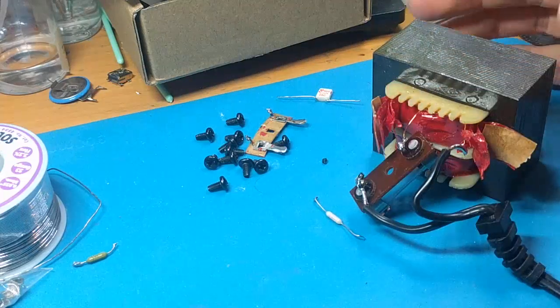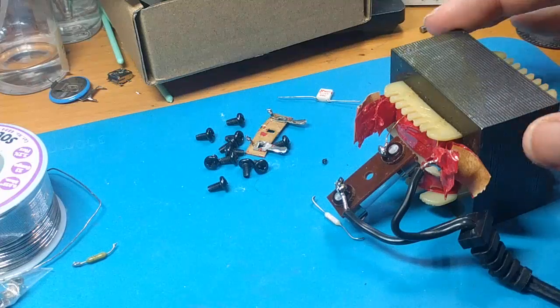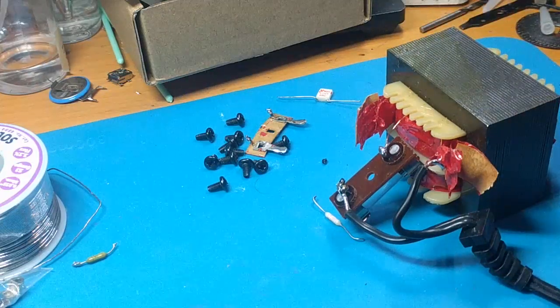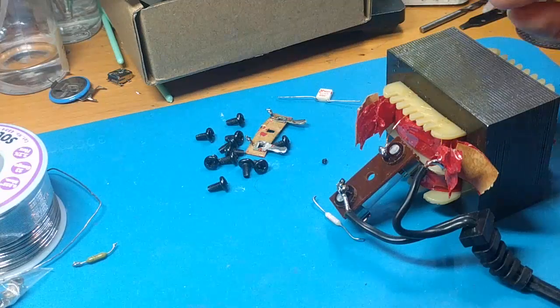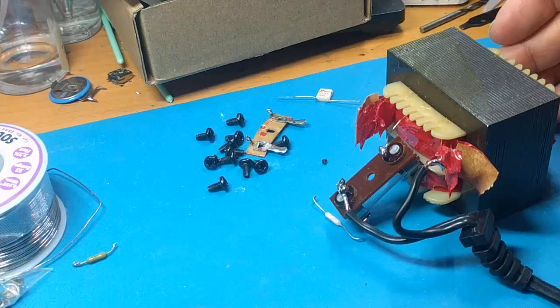And I put in this fuse and I powered it up with gloves. Be safe. Make sure you isolate everything else from your AC wall outlet when you do this, because if something goes wrong, it could potentially blow up everything on that AC outlet line. Have your fire extinguisher close at hand. Gloves, proper precaution, electrically insulated gloves.